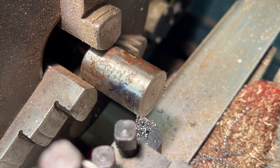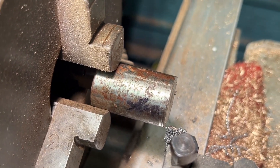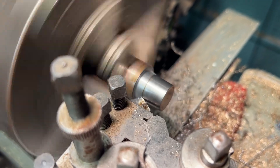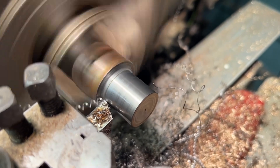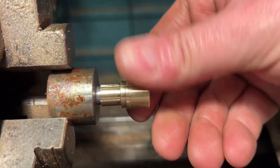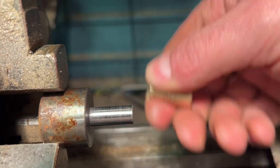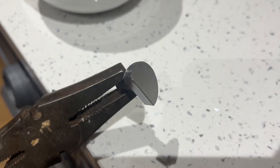I've got a piece of one-inch silver steel and I'm going to try and make the actual rest itself - this is the bit I've been a bit nervous about. I turned down the silver steel to start forming the base for the rest and made sure it fit really smoothly into the collet - tight enough to clamp and hold, but loose enough to lift and raise quite easily. I also put an angle on the rest on the milling machine, which I did off camera.